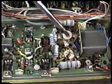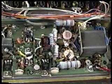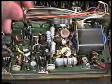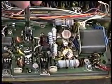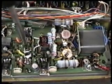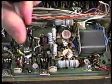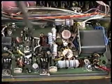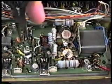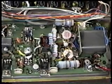Okay, we've gone ahead and removed these 2 screws on each side of the power amplifier transistors. Remove this one from one of the driver transistors, and the other one. You can see that goo there is holding that screw in place. Sometimes if it doesn't want to come out, just take either your fingers or a needle nose pair of pliers and pull it loose.